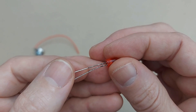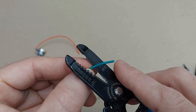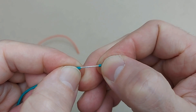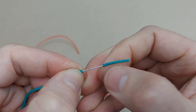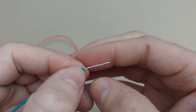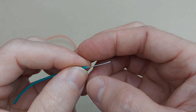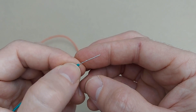Let's move on to our straight-legged component. Again, I'm going to strip a piece of wire and give myself plenty to work with. I use the insulation to twist the strands together to give me the cleanest starting point I can. I don't want to use my fingers to twist the wire because the oil from my fingers will get in the way of the electrical connection and lower the conductivity — so we want to keep our wire clean.